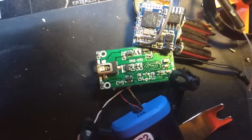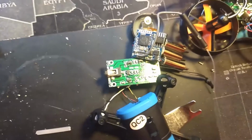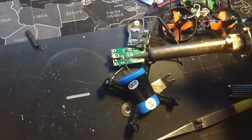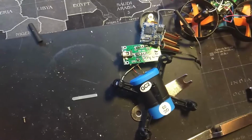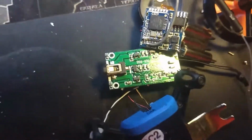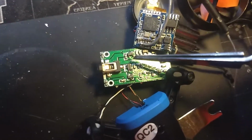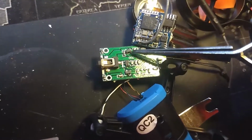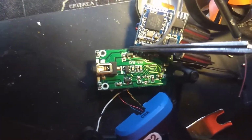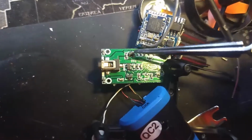What you're going to need to do is find an old brushed little quad and desolder that. You're going to want to use the finest soldering tip you've got. This one is mine, and it needs a bit of a scrub because I'm having a problem getting solder to stick to it. That's besides the point. How I did it was, I have an air gun, but it wasn't quite working for heat. So I took my soldering iron, put a little blob of solder on it to heat the leaded solder they use on these boards, and just touch it, push it, pick it off at the same time. Try the single side first where the single contact is, and then you can flip one side of the MOSFET up, and then just touch this contact and push it away with the heated iron until it's free.